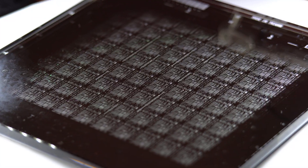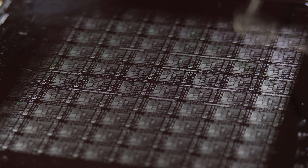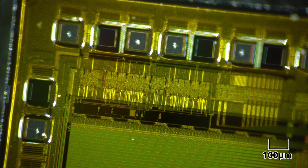The information contained in a mask ROM microchip is physically engraved in the features of the photolithographic mask that's used when manufacturing the chip. General purpose ROM is usually still electronically reprogrammable after the time of manufacture.